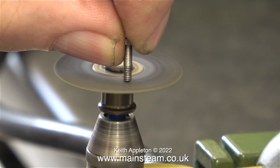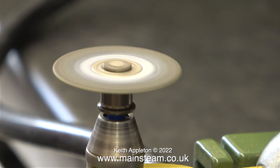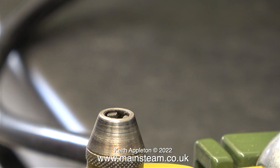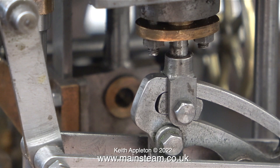After shortening the bolt I just rounded the edges to smooth them off. When I stop the cutting disc you can clearly see the quick release mechanism - it's really well thought out. Now the bolt is the right size I can refit it to the valve fork and through the die block, because now it doesn't foul the two arms that pull the die block from side to side.